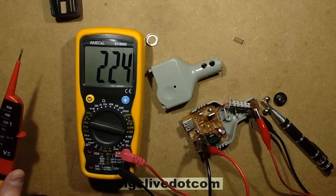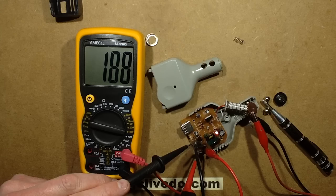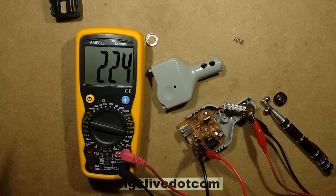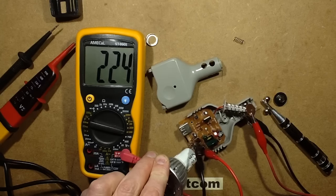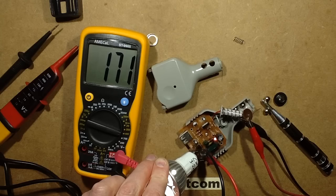So it's now up to about — it's still within the 240V range. Let's stick the test lamps across, put a load in it. Voltage drops to 147 — 180, 190, 200. Current draw is about 100mA. Let's stick a 3W lamp across the output. It's lighting it! It's drawing 177mA at 27V, and the voltage is still loading up quite well.